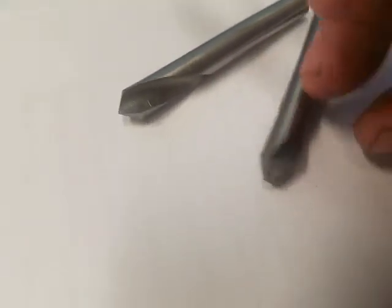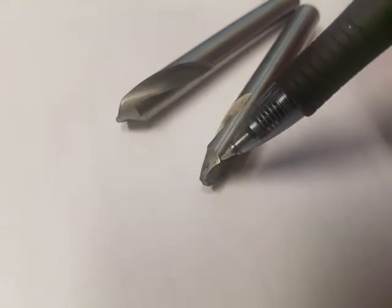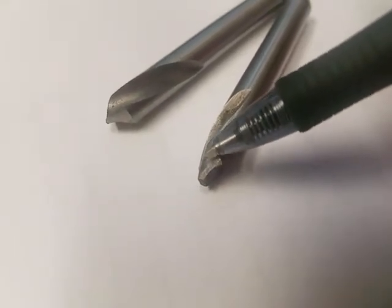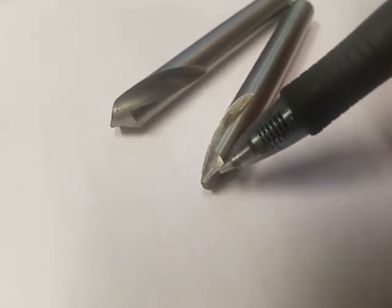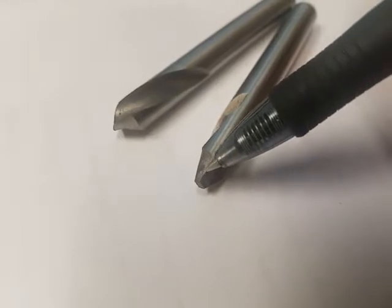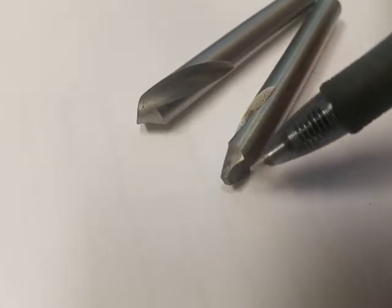In order to use a tool to remove a helicoil, you have to change the geometry so that the back edge — the relief — is now the cutting edge, and vice versa. Not easily, but if you can on a bench grinder, you need to lower the cutting edge, which is the higher edge. If you can grind that down lower than the relief edge, then you should be able to run it in reverse, and this becomes your new cutting edge running counterclockwise. You just have to make sure that the old leading edge is lower than the relief edge.